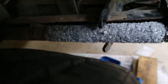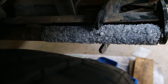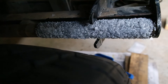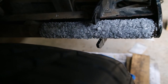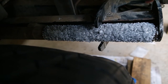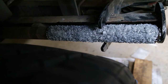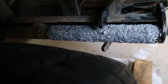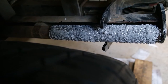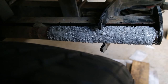It's quite critical too how you mix the part A, part B of the resin. Everything I've read on the net says the mixing quantities are critical, and you also don't use very much. I probably only had a plastic cup with about, I lost a lot the first time, I just had to let it go because you can't keep it. So I reckon you probably need, all up per coat, about 5 millimeters in the bottom of a plastic cup.